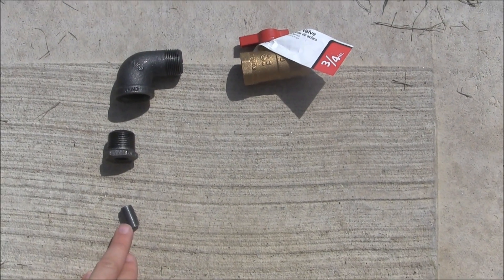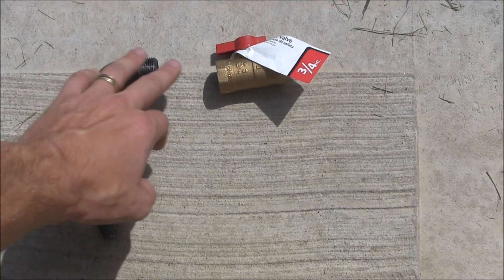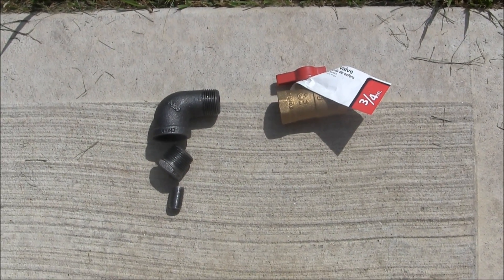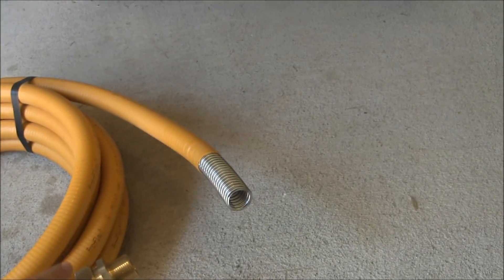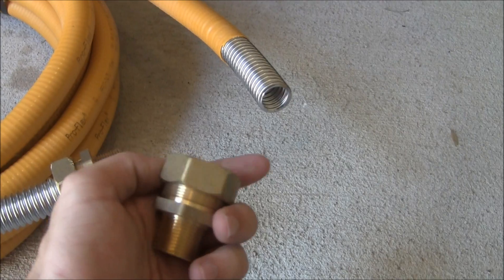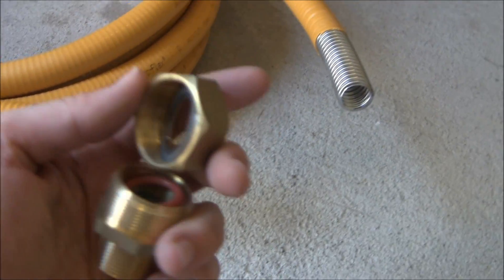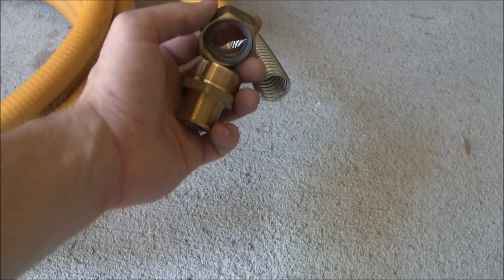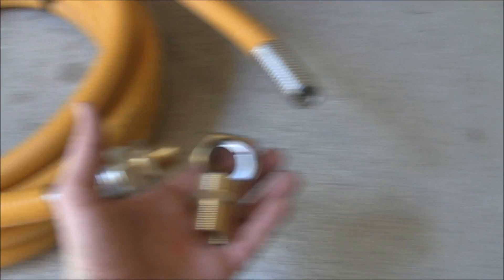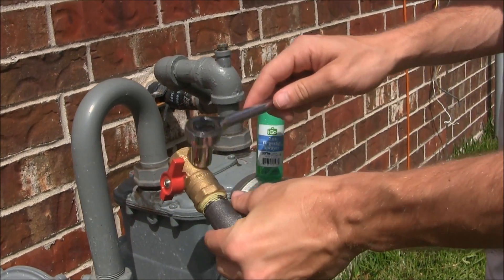Here's what I'll be connecting to the gas meter to tap it for natural gas to the generator. It's a quarter-inch fitting, and this is a bushing — quarter to three-quarters — and then an elbow going into the gas valve. This is not advised by plumbers and would not pass code, but it works for a do-it-yourself application. I just installed the three-quarter inch male end here, and they've got a couple of different rings inside you have to get in the right order, and then the rubber ring, so you put it on and tighten it up.